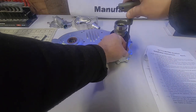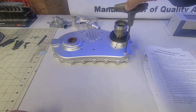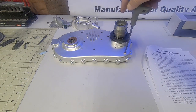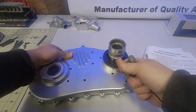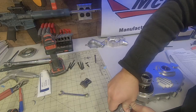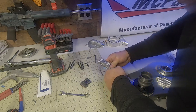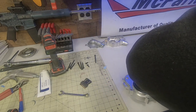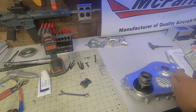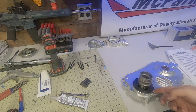On the back half of the case, near the bottom, there's another plug that if you're running a temp sensor for the gearbox oil, you can locate it there. I won't be running a temp sensor so it gets a plug in that spot. Then it's on to applying a thin coat of ultra-gray sealant to the outer diameter of the bearing retainer, where it meets inside the bore of the engine case. No need for a ton here, just a thin coat.